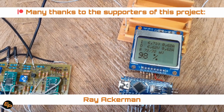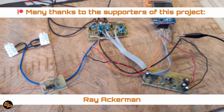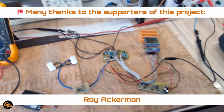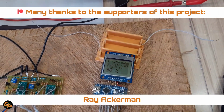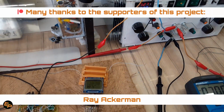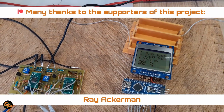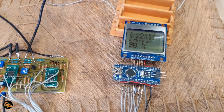The idea is that if you plan to use DC-DC converters for a longer period of time, especially in a context like we are trying to prepare, where we are producing our own electricity, and obviously we do not want to waste too much electricity, we would be concerned with how efficient those DC-DC converters are. It doesn't matter if you buy DC-DC converters from the market or if you manufacture them yourself. It doesn't matter if they are step down or step up. The efficiency matters to a certain degree, and just because you buy a DC-DC converter from the market does not mean that it is efficient, that it has a 90% or higher efficiency level. No, not at all.